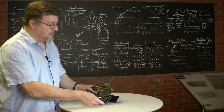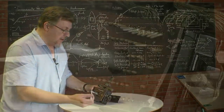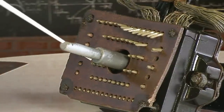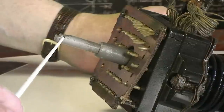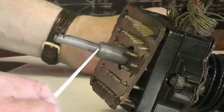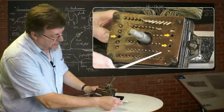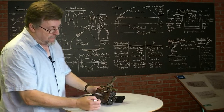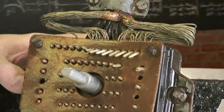The most noticeable thing is this stem in the centre of the plug. This is quite a substantial component and we've got this step — this step is a seating zone for a spring located in the socket. Right on the tip there would be a solenoid-driven electromechanical locking system in the socket that locked into that tooth. For orientation we've got these empty ports which have no electrical connections at the back, which probably helped key that together. This plate has got 65 connections on it, but if you count up the cabling there are only about 60 good connections actually going to this one.